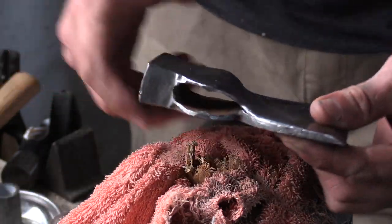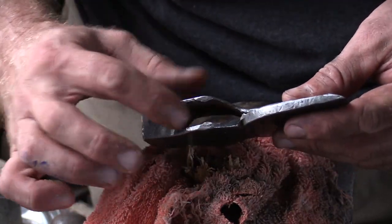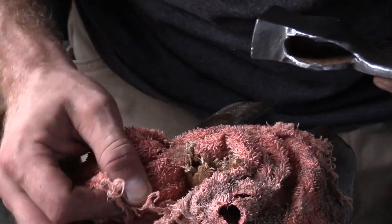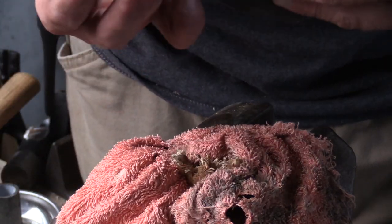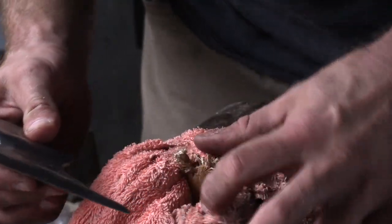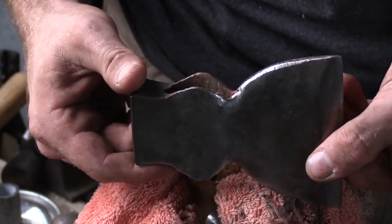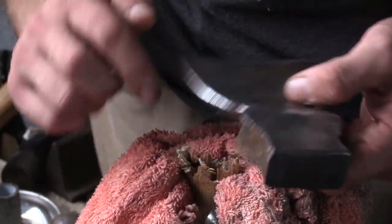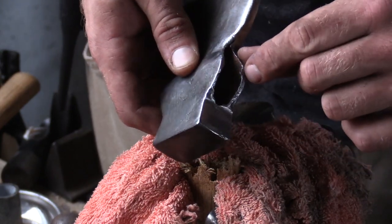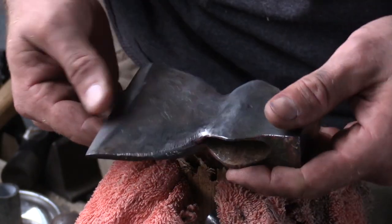That's out. You can see there's a little bit of damage here — honestly that was there before I did anything with this. It came out with the broken pieces all mangled in there. It seems like part of it was glued up in there, but the bottom half wasn't. So where I had to chip away — there was some epoxy or something. Now I'm going to put this back in my vise, clean up some of this edging, get rid of these little lips. I'm going to take just a file and go in there and file that out, and then we'll be ready to re-handle this.